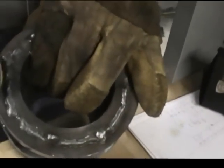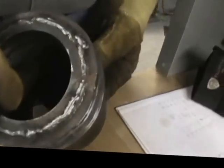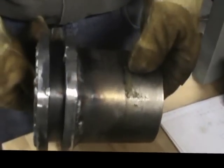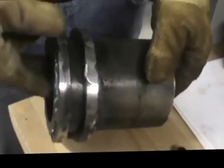And Byron will set that in the lathe and turn that to be just a little bit bigger than the 3/4, so we have a little slop in there. And he'll clean that all up, true everything up. Those welds will get cleaned off with a milling tool as he does it, so you don't see all that. And this will look like a machine piece when he's all done with it. And it'll be really interesting to see what it looks like after this point. So next video we'll have this cleaned up and you'll see what it's going to look like.